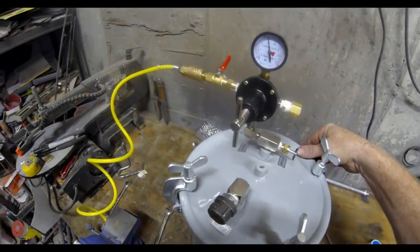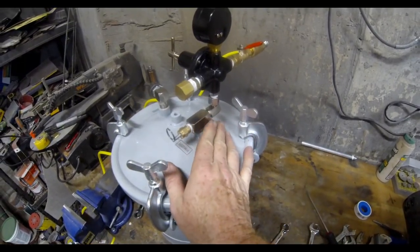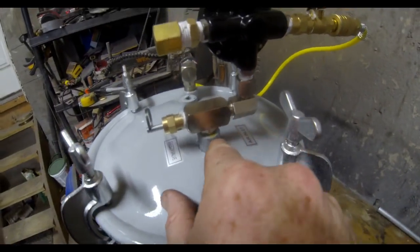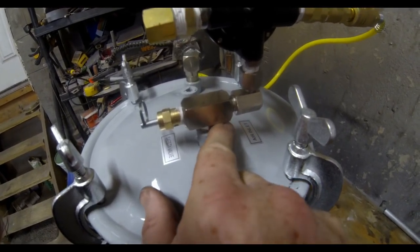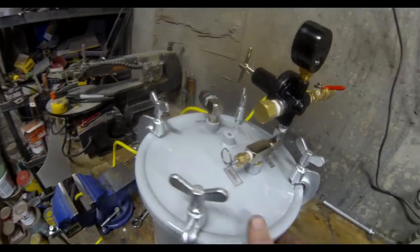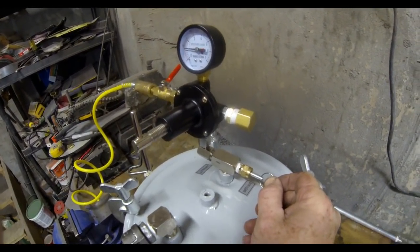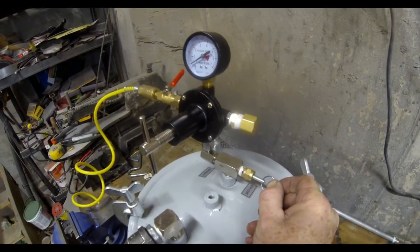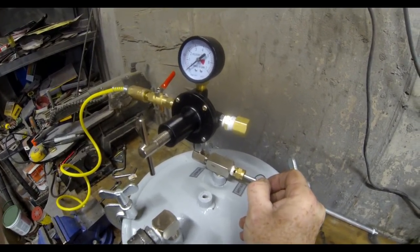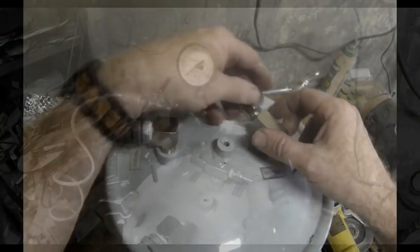So now I'm going to test the pressure. I've hooked it up to my compressor, got it up to 45 psi, and I feel a leak. There's definitely air leaking out of the tank right back by this fitting going into the lid — I don't feel any air coming out anywhere else. So I'm going to purge this. I've turned off the air to my compressor and I'm going to use the pressure relief valve to purge the air inside the tank before I unclamp it. If you attempted to unclamp this while it still had pressure, that would definitely be a problem — you always want to release all pressure before taking the lid off.